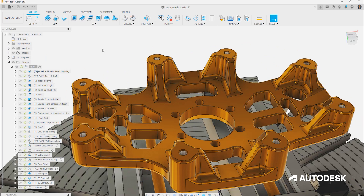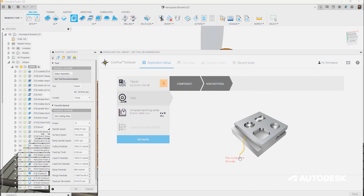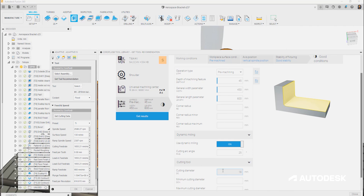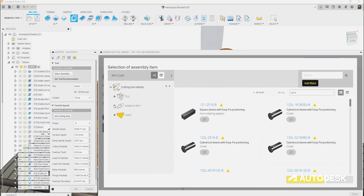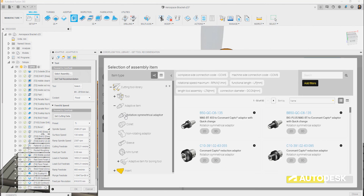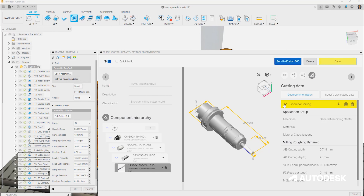For the inner portions of this component we use our 3D adaptive roughing strategy. We'll use the CoroPlus tool library to ensure the correct tool is chosen and the recommended cutting parameters are applied. We start by defining the type of geometry we're cutting, the depth of cut, and conveying to the tool library that we're using adaptive or dynamic milling strategies optimized to utilize the full flute length. We then choose the exact tool and build the full assembly — from the collet to the CoroChuck 930 holder and the interface with our HSK100 spindle — and send the full representation to Fusion, including cutting parameters, recommended step down, and step over.